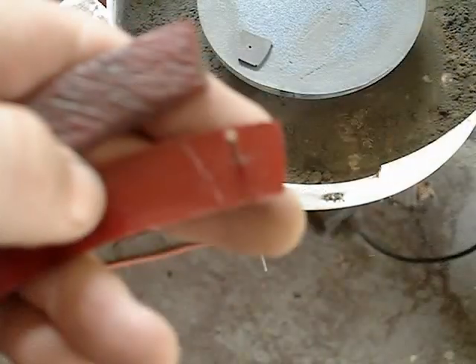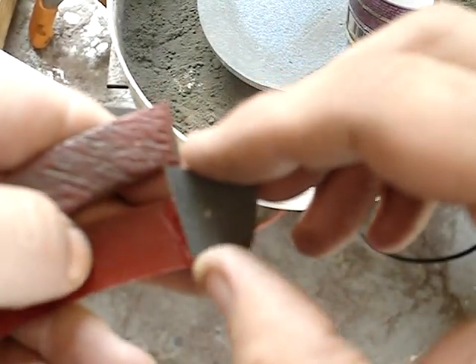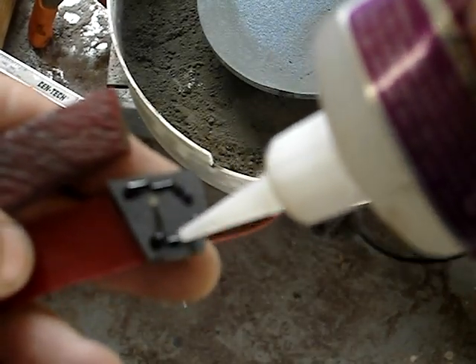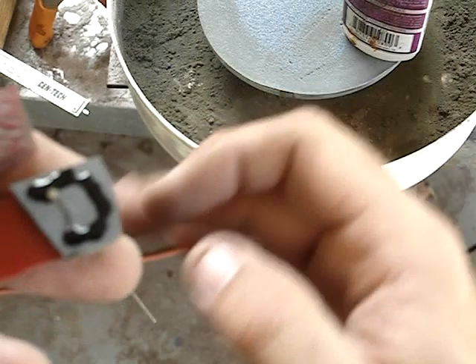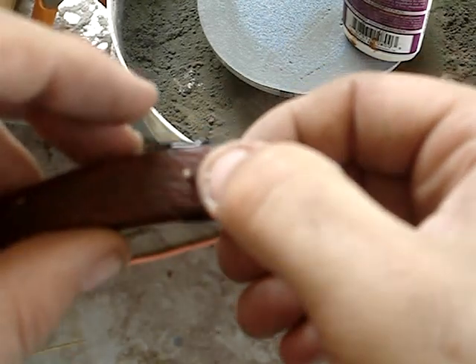Here I am gluing it up. It is medium viscosity super glue and I have the front of the razor already mock-pinned together. I will line it up with the scribe line I scribed earlier. Now with the pin running through both sides — both ends of the razor — I will put a spring clamp on and let it dry.